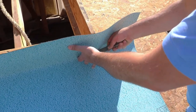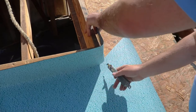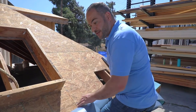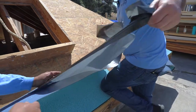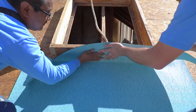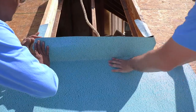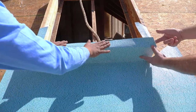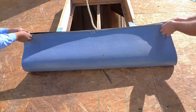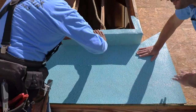On this first layer, we want to cut it at a 45-degree angle up towards the top slope of the roof. That's going to allow us to bend this over. Then the second layer we're going to cut at an angle going down to make sure that the corner is fully protected. Now that we've got it cut and lined, you want to hold it in place and just remove your adhesive backing, then slowly slide it in place. It's really easy to do with two people to make sure you get a nice tight seam and it's properly aligned. You can fold in the corners, then once you've got the top in place, just lift the bottom half, remove your film, and let it drop. Smooth it out with your hands to make sure you don't have any wrinkles.